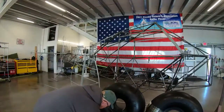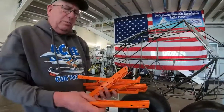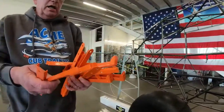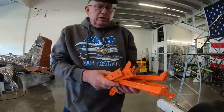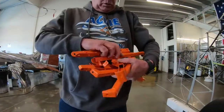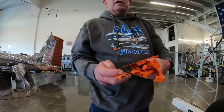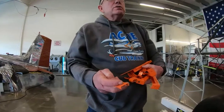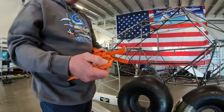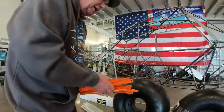We've got wing parts here already powder coated. Whenever I rebuild an airplane I always put on new lift strut attach brackets — front and rear — because the hole on the square end that attaches the lift struts to the wing gets elongated. So anytime we rebuild a wing we always change the front and rear lift strut attach brackets.